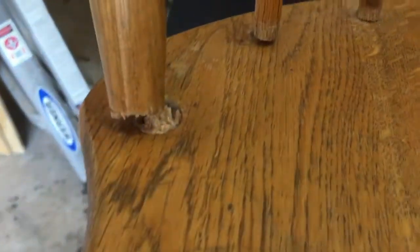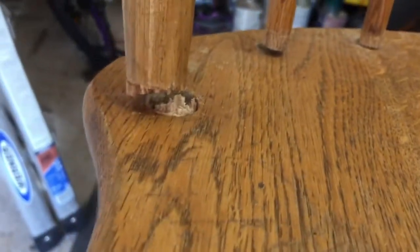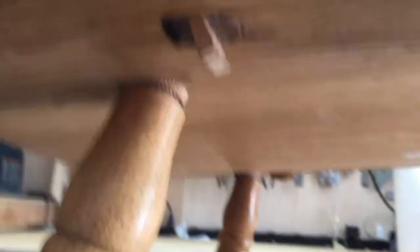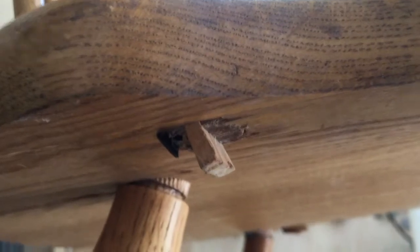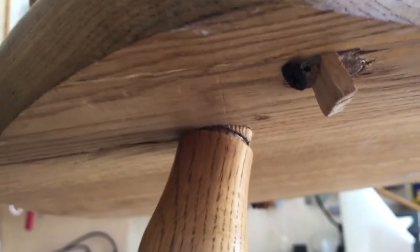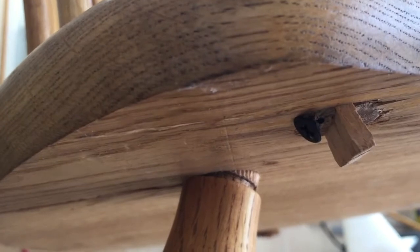Here's the harder part — and this is kind of the interesting part. This side of the chair has broken completely from the wood. You can see how this was made too. Here's another mistake I think they made in production: this piece goes all the way through there, and there's a wedge that goes there to tighten it and keep it tight. But then they put a screw — they actually put them under the legs in the front too. I would guess that the screw probably weakened the wood enough and created a small crack that eventually, over time, this thing broke.